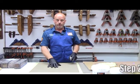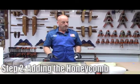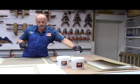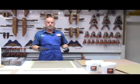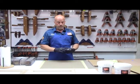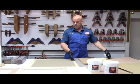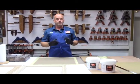Formica for the front and the back. And you don't have to use a brand new sheet. You can use scrap that you have in the shop. That's what I've used. Notice this is one color. There's a couple different colors throughout this. I'm just using scrap pieces. The reason for that is the veneer will go over the top of the mica. The mica has to go through the thickness sander after we get this glued up. So if you're noticing that we have different colors, that's the reason why. You're never gonna see it. I'm using it as a thickness flattening laminate.